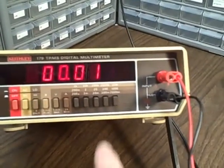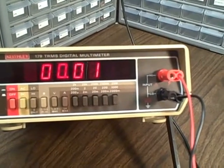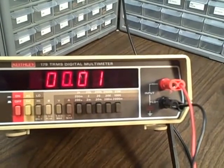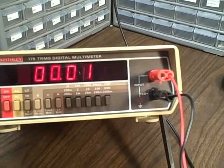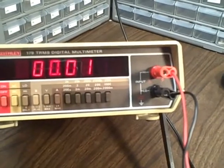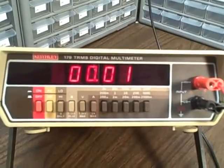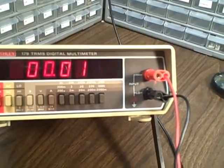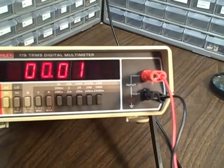They basically recommend that you do most of your readings 20 kilohms and up in the high position, and then your usual low position for the 2K — unless you were testing in-circuit, in which case you're free to use the low ohms in the 20 and 200K as well. So it's an interesting feature that could come in very useful in some in-circuit testing. We also have voltage up to a kilovolt maximum, and amperage up to 2 amps that we're able to measure.